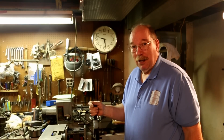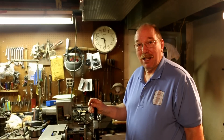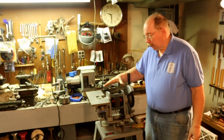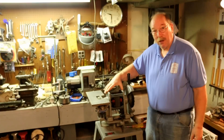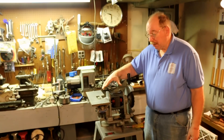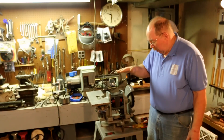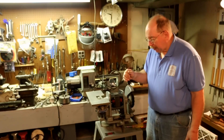If I was a motor rebuilder instead of an industrial electrician, I might be able to do something with this, but I don't want to learn that skill now. If the motor does fail, then it's toast, but I have a spare. I'm also thinking this is a pretty common style motor — Foley Bell Saw used a motor that was common for Sears grinders; same frame. Hopefully the winding is going to be all right. I got the cover off, got everything cooled off and checked everything out — it looks to be okay. We'll just have to give it a try and see what happens.